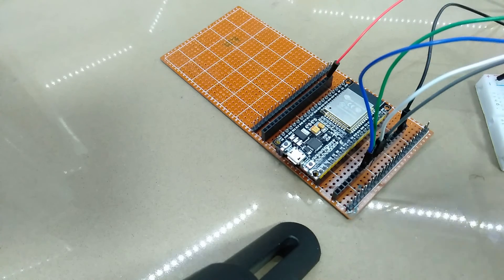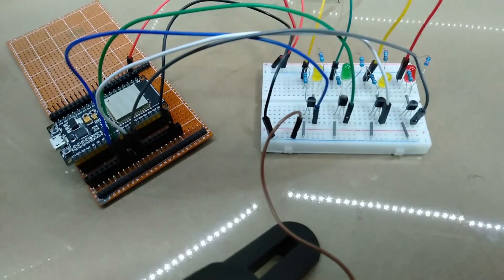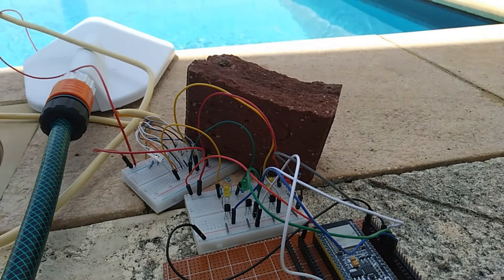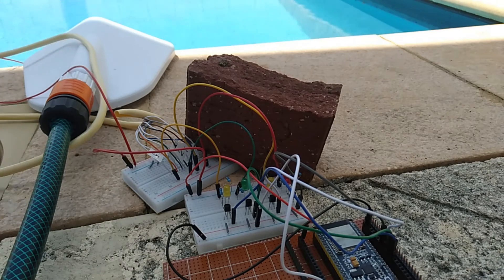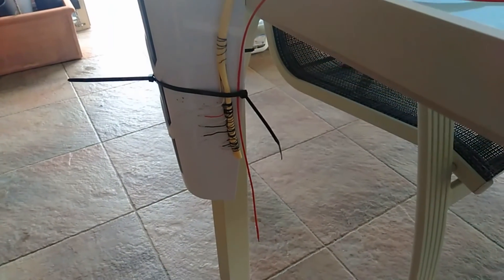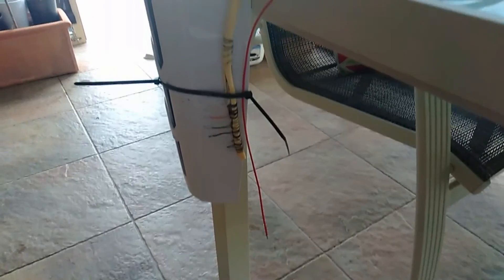Since I wanted multiple wires to detect different levels, I've repeated the same circuit four times and hooked it all up to the ESP32. I put the power line into the water and have four sense wires at different heights. As you can see, depending on the depth, the different lights light up. For a first prototype I've cable-tied this onto the water dispenser. There will probably be trouble with corrosion of the wires and other components, but this is a first attempt to see how it goes.